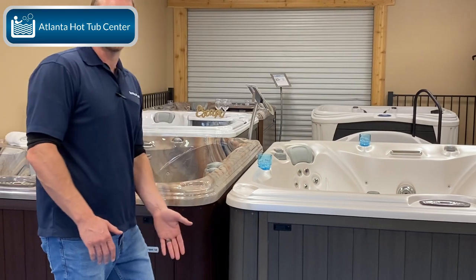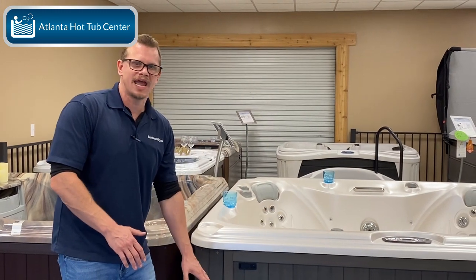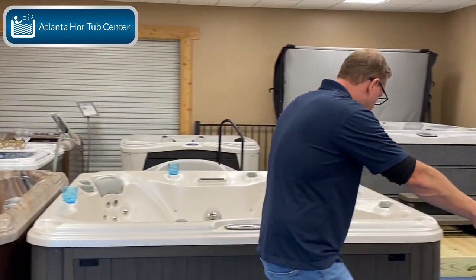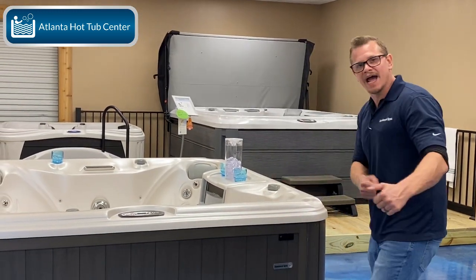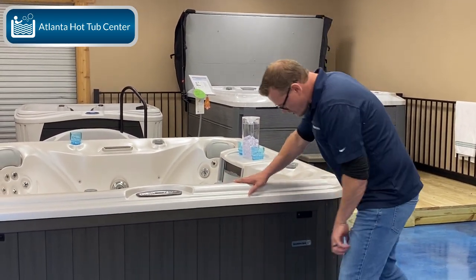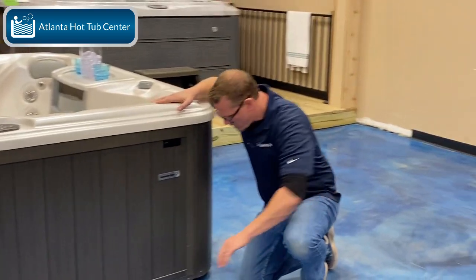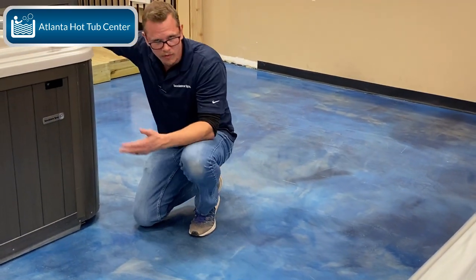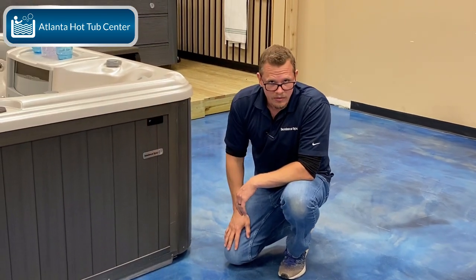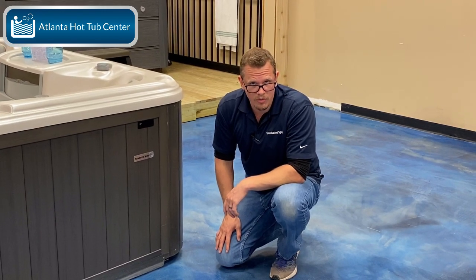What I say is: come off this corner, come out 36 inches, then bring that trap door all the way to the other corner — 36 inches. Now if it's sitting on concrete it doesn't really matter because the tech will have a place to stand. But if you put this on an eight-foot-high deck and you make a 36-inch trap door and the tech jumps down there, he's falling 10 feet. You've got to make that sub-platform 36 inches as well — or 38, 40 inches, whatever your trap door size is.